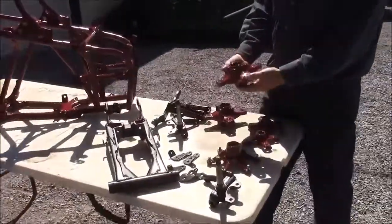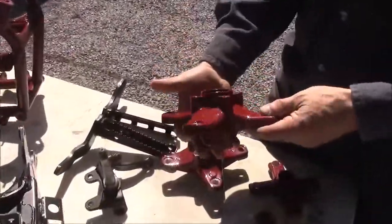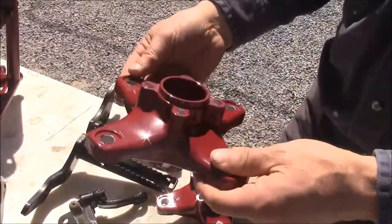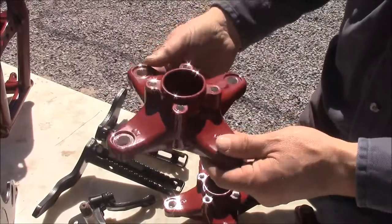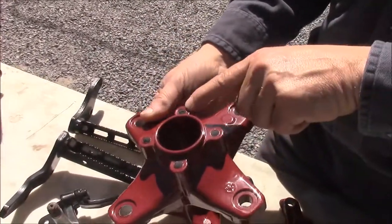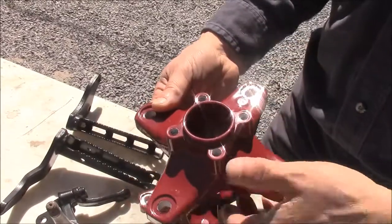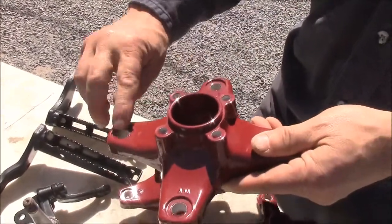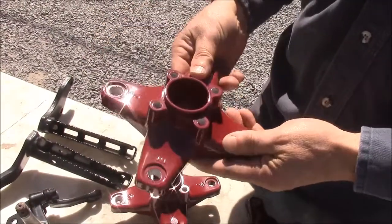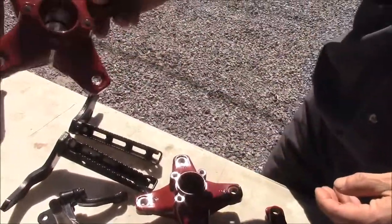We've got two different colors. This is like a wine color, and you can see we've done all of the sides of these hubs, and you can see some important little things. I think the camera can pick it up. You can see where we've protected the threads. We have special bits that we put inside so we don't get too much powder coating in all of the threads. But that's a really nice wine burgundy color.